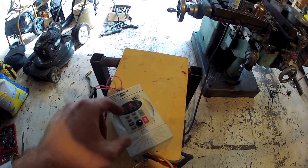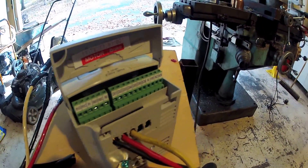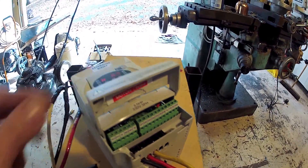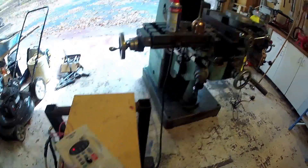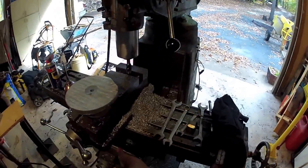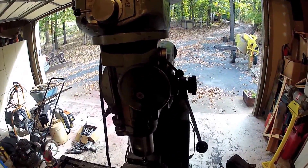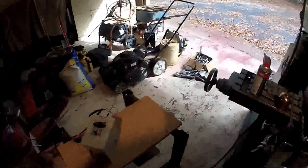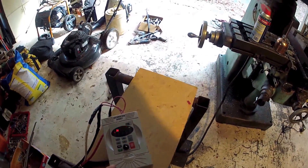So I'll probably look to use another feature of this — by opening this up, it allows you to connect low-voltage auxiliary or remote controls, so you can duplicate the functions of the faceplate remotely. A machine like this really needs an emergency stop button somewhere — somewhere big, somewhere easily accessible. In case you break a bit, or somebody gets hurt, you need to shut the machine down immediately. Fumbling for these little controls is fine for speed adjustment, but not for an emergency situation.